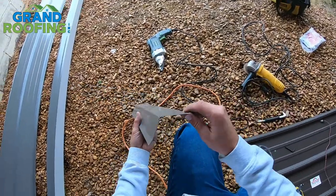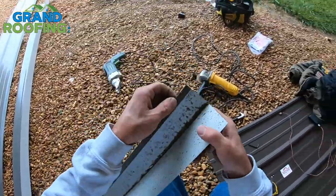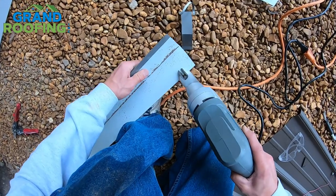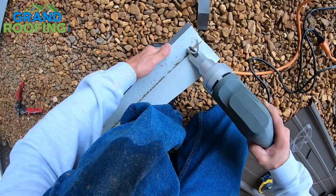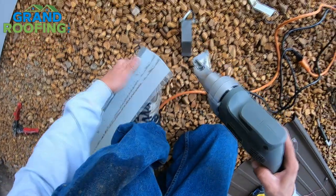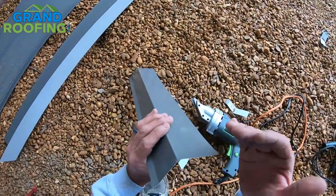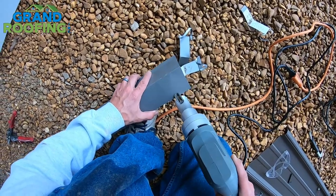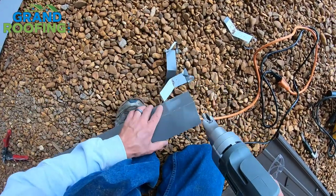Here's a scrap piece of apron flashing — it's a single piece of steel that's hemmed over, so essentially it's two pieces thick at the edge. Starting the cut is no problem, finishing is no problem. Be aware the bend angle is going to be the hardest part; it may be easier to approach from the top side rather than the bottom.